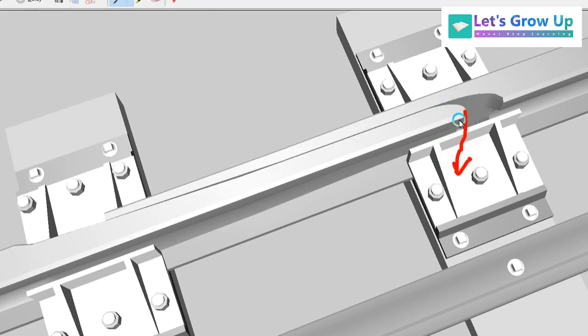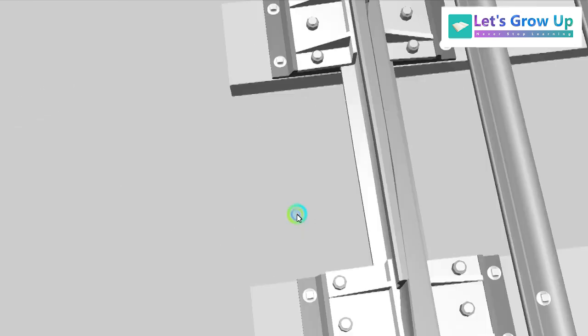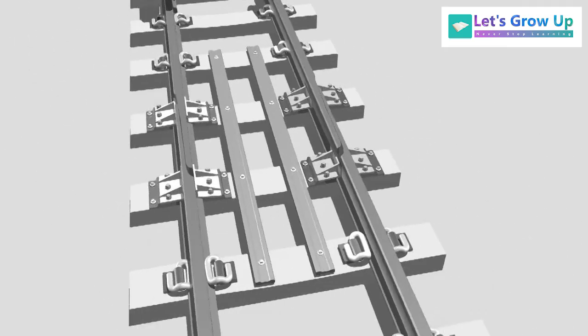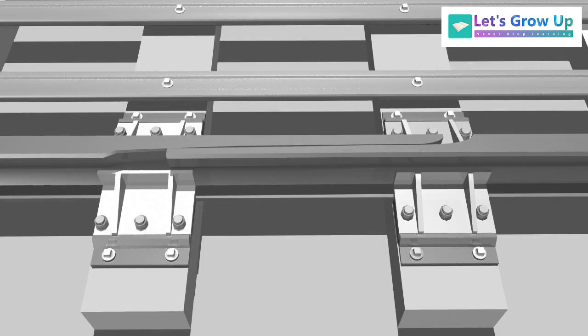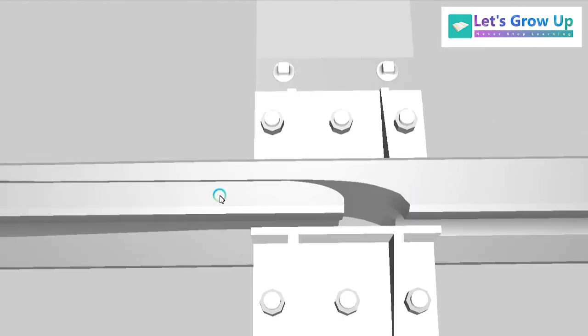This is the tongue rail — you can see it is shaped like a tongue. And here you can see the stock rail. Both the tongue rail and the stock rail are running rails. There is a space between them for sliding. It is a basic property of metal that due to temperature variation the track expands and also contracts. When the track absorbs heat it automatically increases in length, so that space is very, very important.